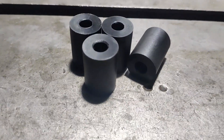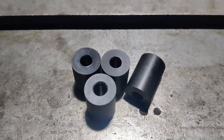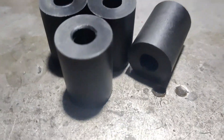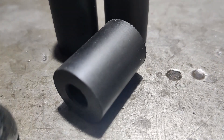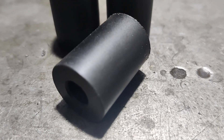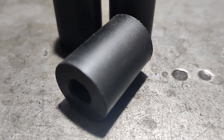Well, that's the bushes done. They're just little spacers — I'll show you in a minute on the engine where they're going. Delrin is always very nice to machine, always gives a nice finish. You don't need any particular special tools for it. Turn it quite fast and cut it hard and it comes out really nice.